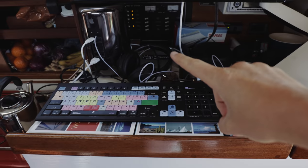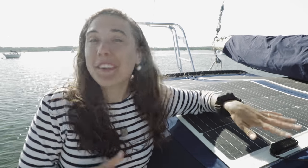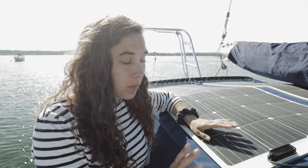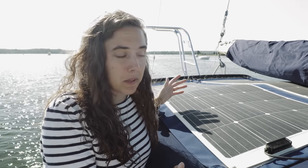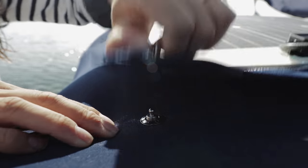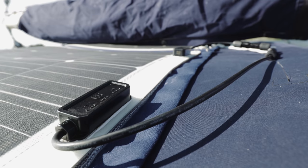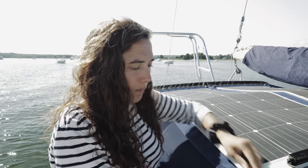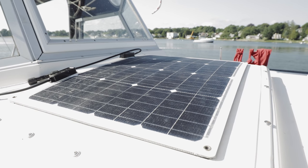This video was edited entirely with solar power. Through the magic of editing, you've been fast-forwarded two months in time — the boat is in the water and we are happily living aboard. It's only a few days into our experience but the panels are doing great. We have two 160-watt flexible panels that are super durable, exactly what we needed. There's not a lot of places to put panels on a boat, so we leveraged all the space we had on the Bimini. I'm really proud of the contraption David and I built — the panels are secure but also easy to take off in case of a storm.